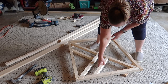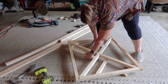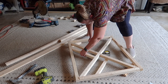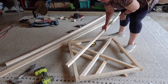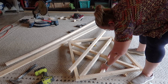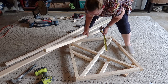I do have wood glue but I didn't use it at this point — I didn't use it until I was ready to put in the wood filler. Honestly I don't know why, because it would have been really helpful to hold the boards in place while measuring the others. I also could have been nailing them in place as I went, because the boards not staying in place was the biggest problem when trying to measure the next one. Hindsight is 20/20 — if I build one again, I'll just tack a little nail in there to hold it and then add more nails once I'm finished.